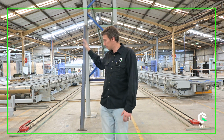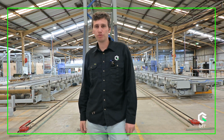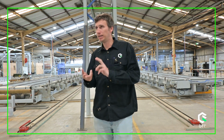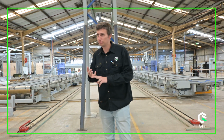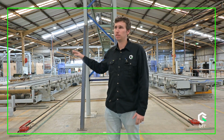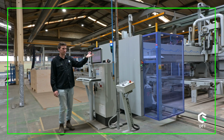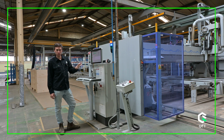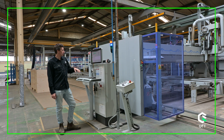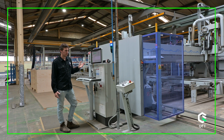So the next stage here, we work on the internals of your wall panel, so that's your insulation, any electrical services, any hydraulics if we're going to pre-rough those in. So that's the start of CNC number 2. As I've just explained, at CNC 2 we've done the internal gyprock, flipped it over, insulated it, got all electrical services in and other internal gadgets that need to go into the wall panels. This is then our exact same mirror, CNC 2, same CNC bridge, does the same things, but this works on the external side of the wall.